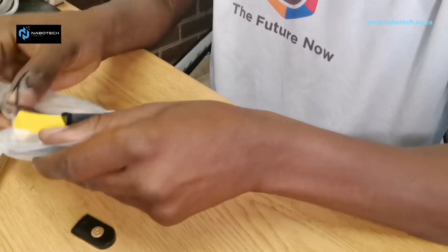It's a non-neutral switch — ideal for houses with old installations or newer builds where electricians didn't run a neutral to the switch box. You only have the live and the return. The neutral is done on the roof. This has been a breakthrough for home automation. It's a good product, my clients are happy, and I haven't had any complaints.